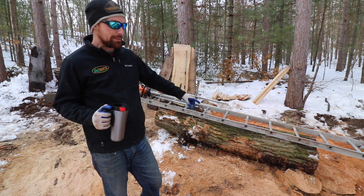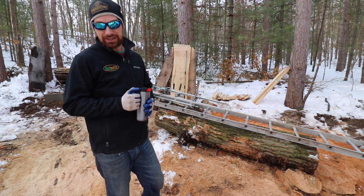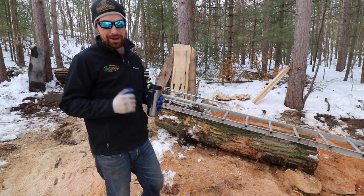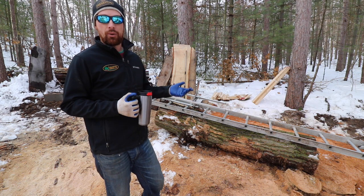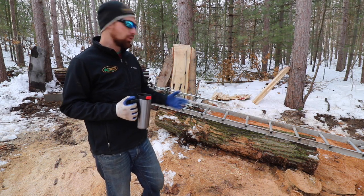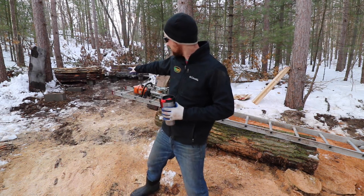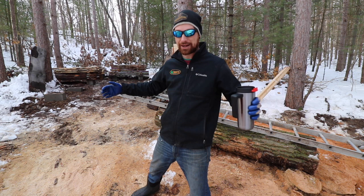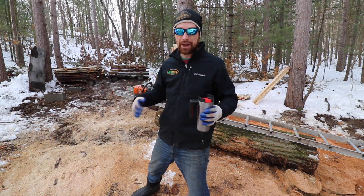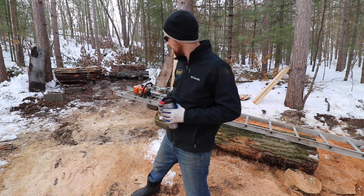This cottonwood has only been cut for about 2 months, so we're gonna slab this up today. This one's gonna need to be ratchet strapped down because it is still fairly wet, so it does have a chance to cup or bow or twist or whatever you want to call it. So I have some cinder blocks leveled already, and I level the front to back, side to side, everything straight across. That way everything that's sitting on top of it stays fairly straight.